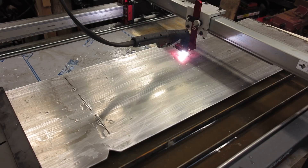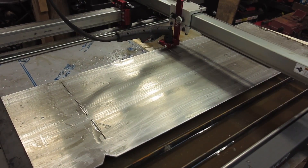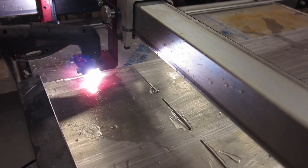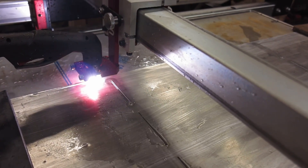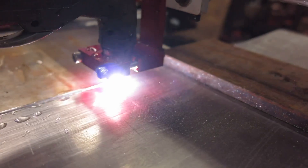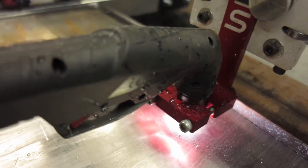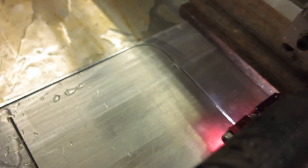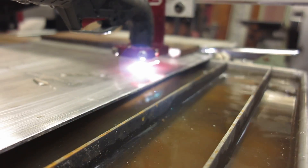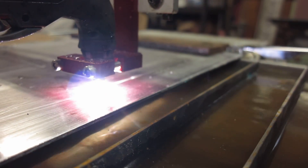If you're familiar with my quad truck, in one of my past videos I made some aluminum fenders from scratch — I had to cut everything on my table saw. It took forever cutting out the parts and welding them together. But now it was so simple to program on the CNC. I programmed some rear fenders to kind of match, and it took no time at all to cut them. I don't have a metal brake yet, so I cut stitch lines in for making bending a lot easier. Now I'm cutting out the parts and we're going to be building some rear fenders.